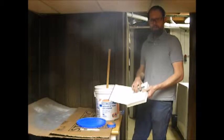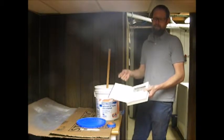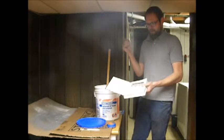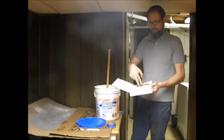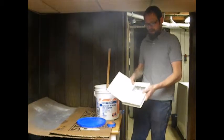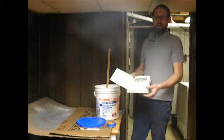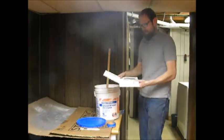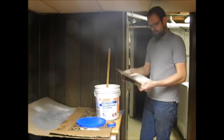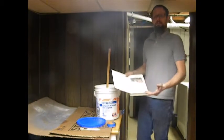There's a few different ways you can do it. You can do it by hand with a knife. Some people have had luck with an oscillating tool, the straight edge fast oscillating tools. I'm using a mill at work just because that's the most automated way I can do it. I just have a jig that I bolted into, routes it out, and then it also pokes the hole in the back for the USB charger. But you can use whatever works for you.